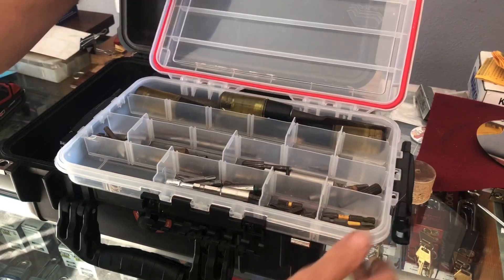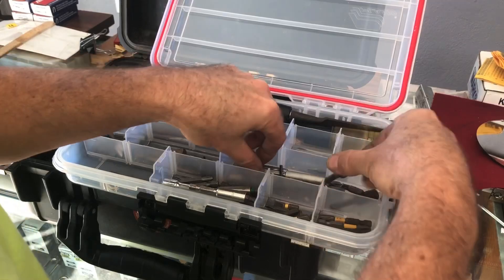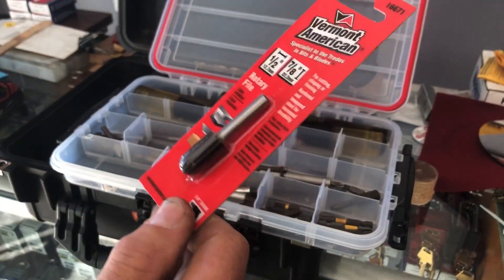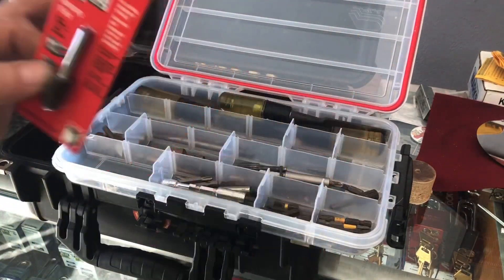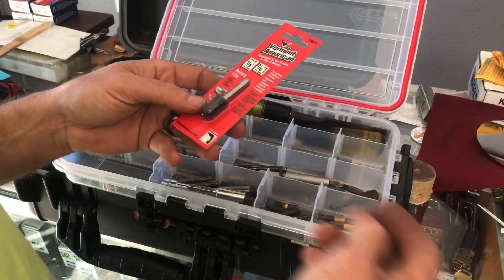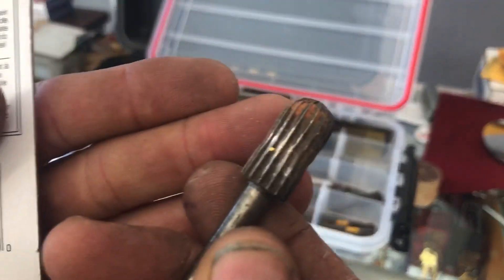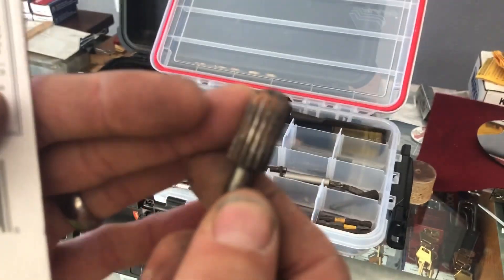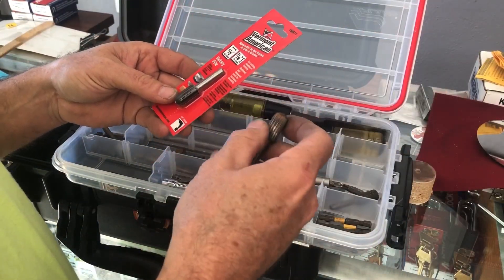It's like velcro, it's hard to hide that. These are little burrs — here in the south we have big problems with Yazoo clay, so frequently we have to adjust strike plates internally to make them bigger. I know everybody says you just move it up and down, but sometimes you can't do that, so this is one alternative. As you can see they get kind of routed out pretty quick — people have recommended buying die grinder bits that would last longer.